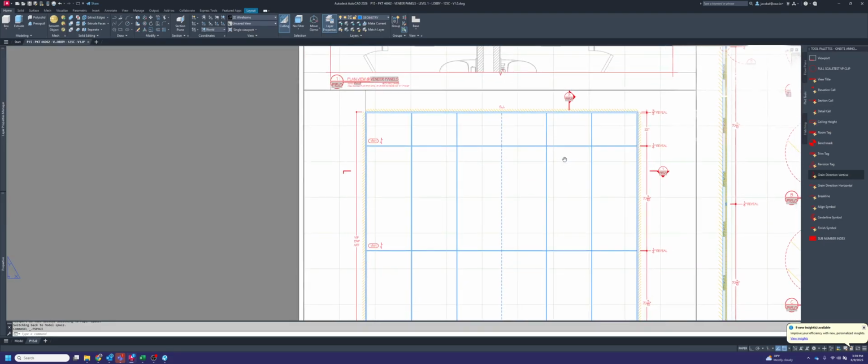And again, what a shop joint means is that this panel is really going to be in two pieces when it's being produced, but the shop is going to assemble this panel as one piece. So what they're going to do is take those two panels and dowel and glue, or biscuit and glue, those two panels together.